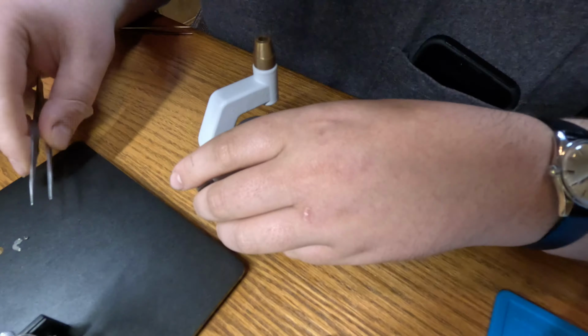So here you can see me reinstalling this friction fit wheel onto this cannon pinion. I dropped this tool in here with the cannon pinion in there to line it up. And once I have it lined up center, I'll tighten it down. We'll go ahead and put this wheel over to the cannon pinion, and then use this press tool to press it back flat on top of the wheel.